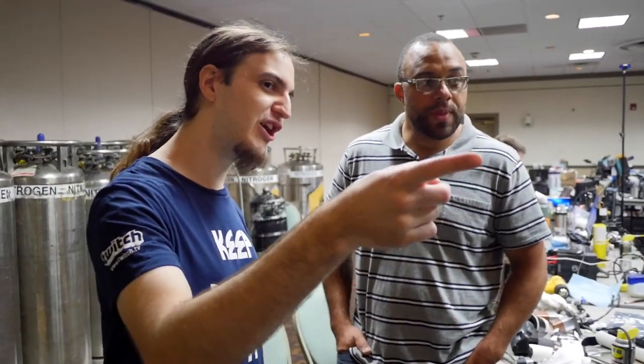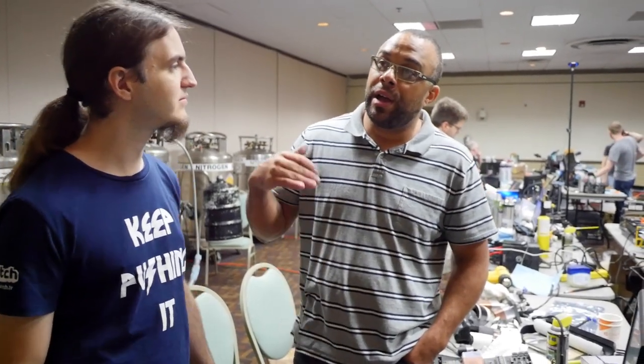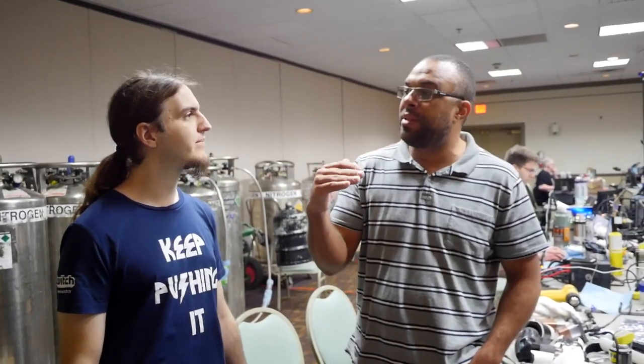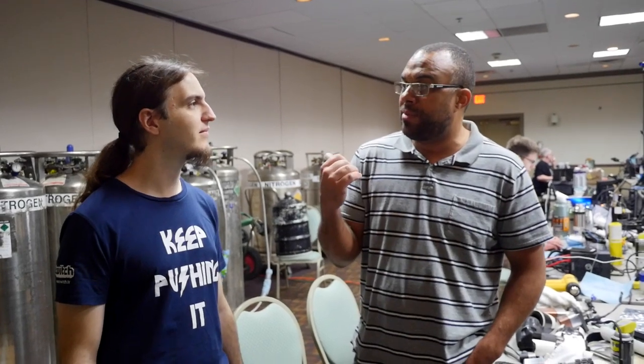That's already good. How high in pressure can you go on the tanks? Is there a limitation? You know what? If somebody wanted one that was 1,000 PSI, we could build one that's 1,000 PSI. It's just a matter of the valve, and then we'd need to change some tolerances and stuff, but these are 22 PSI. We were running at 50, so that's another big hurdle. We were buying the 235 tanks, bleeding them down to 50, and then they pretty much regulate at 50 once you bleed them down.